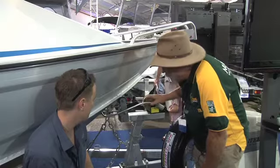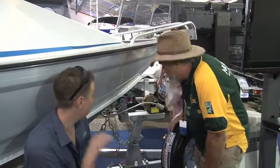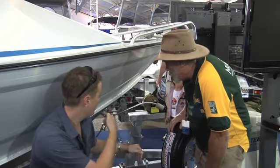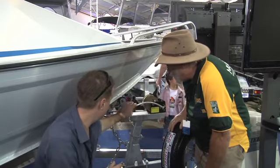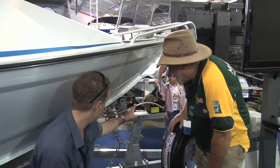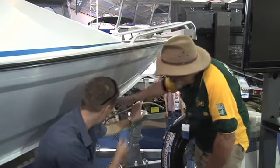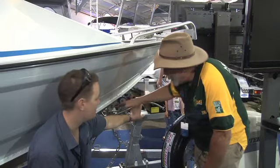What about when you're putting the boat in the water? Right, to launch the boat, get your wheels wet, so you're right down the bottom of the ramp. One guy jumps in the boat, the other guy operates the winch. He slides the weight to the back, and he lets you winch off a couple of turns. So then it'll go back and sit on there? Correct, that's okay, jammed in there.